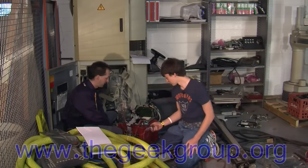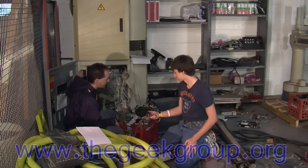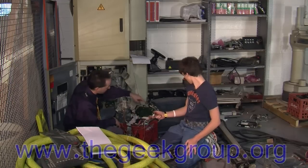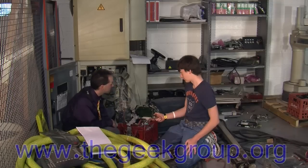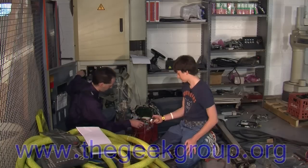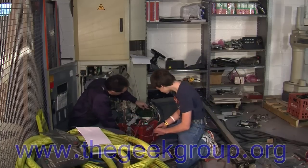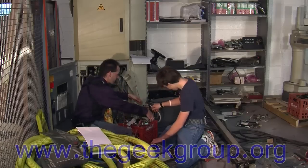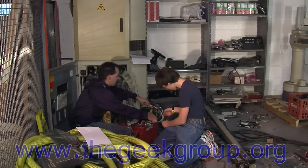All right, ready? Yep. All right, one, two, three. Okay, I saw your POST lights come up. Fans up. Turn off. Hold it. I see what your problem is. What? Video card wasn't seated. Is the other card seated? Oh, it's on the motherboard, that's why. Oh, okay.